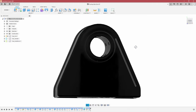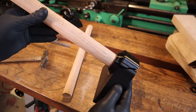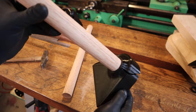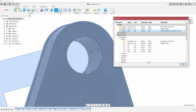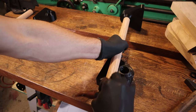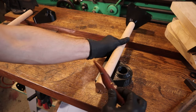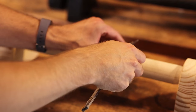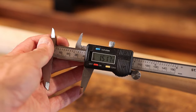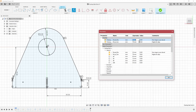To prevent rotation I've added nibs which lock the dowel in position along the length. On my first attempt I underestimated the amount of force required to compress the wood and the end cracked. To prevent that problem I resized the nibs to be smaller and I've also resized the dowels as needed, because not all store-bought dowels are the same size. If you're interested in making your own, I'd suggest going with the inch-and-a-half poplar dowel — it's cheaper, conforms better, and there's less chance of cracking on the ends. I've modified the design to accommodate both inch-and-a-quarter and inch-and-a-half dowels.